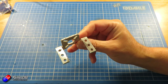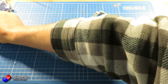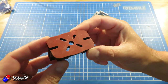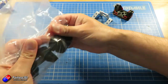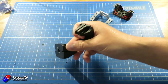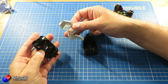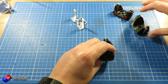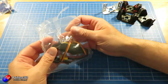Before breaking out the exacto glue, we need to go through the pieces we have to put on the actual airframe. This is the bracket that was supplied with it - it's kind of a bent aluminium. I don't think I'm going to use that because in the kit that I bought with the upgraded motor, we had these 3D printed motor mounts, which I think would do a much better job. The weight isn't that different, and to be honest the motor is so heavy anyway, I don't think that's going to be an issue.